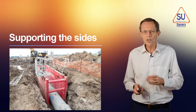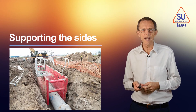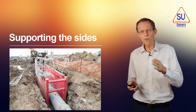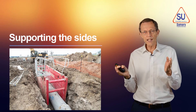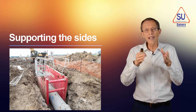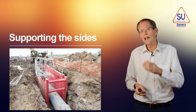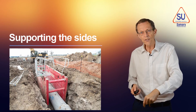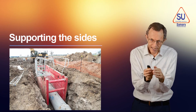In reality, the ground can be difficult to dig, hard and broken, wet and slippery. The main piece of equipment shown here is what we call a drag box — a strong box for people to work in safely that holds up the sides of the excavation. The excavator digs the hole and pulls the drag box along; the people adding lengths of pipe stay inside the box and will not be in the trench unless they're in the box. The key message is we're holding up the sides of the excavation so it doesn't collapse and kill people.